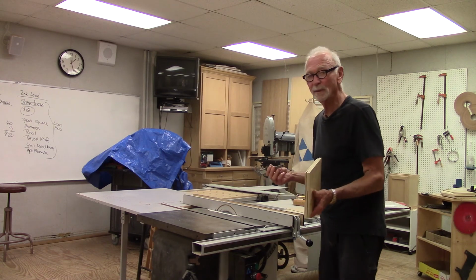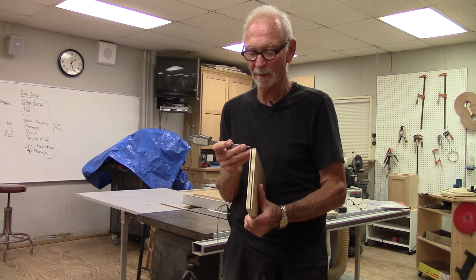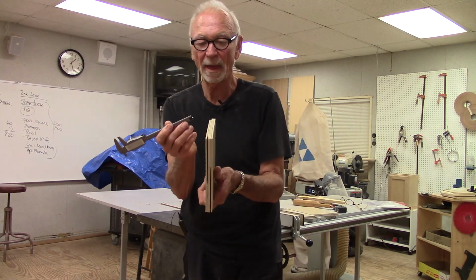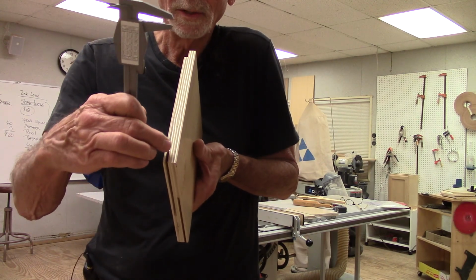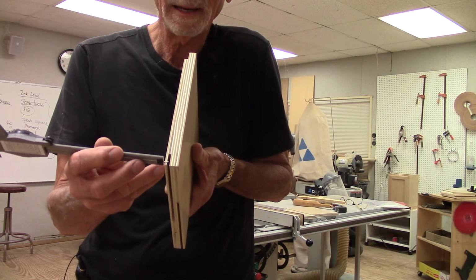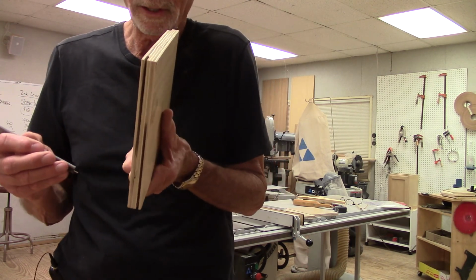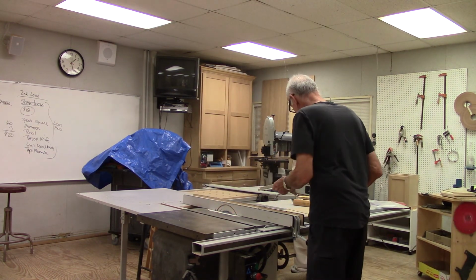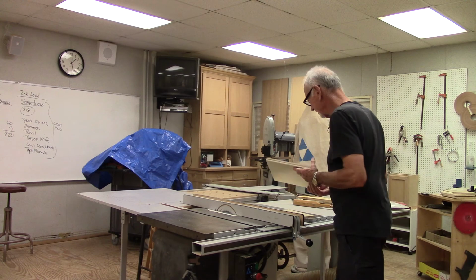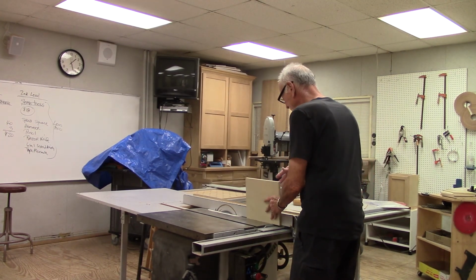And let's see, this one doesn't matter all that much unless it's got to be a specific rabbet, but let's go ahead and see what we're doing there. And that's right on 1/4 of an inch. Perfect. That part right there, from the fence to the outside of the cut, is right on 1/4 inch. And that's what we want. That's going to give us our 1/4 by 3/4 rabbet. So let's go ahead and do that rabbet. The first cut, which is always this long cut.